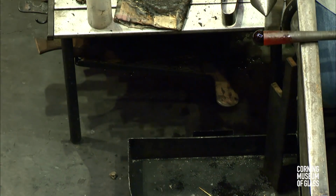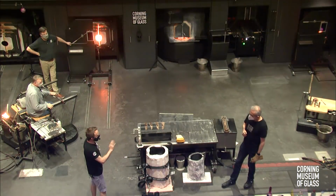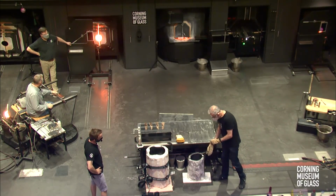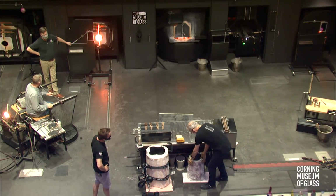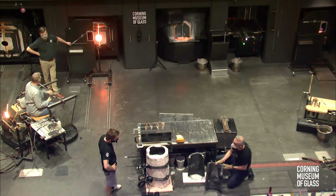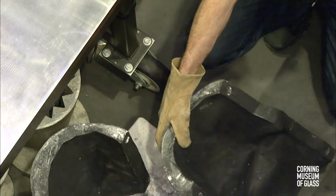And I put that on with an alcohol, and that soaks into the surface of the mold. Nice. And then you actually buffed that too to get a nice sheen to the graphite. Yeah, a nice sheen. So we can actually see that if we open up this mold as we finished using it. You can see here, I don't know if we can get a camera on that. There we are.